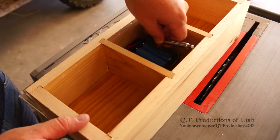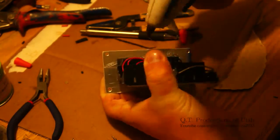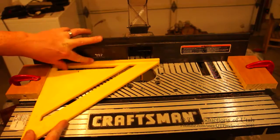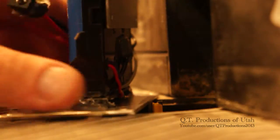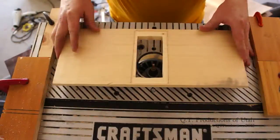I set my battery inside and mark a rectangular hole around the top end, which I then cut out. I drill carefully marked holes into another piece of aluminum and hot glue tiny squares of plexiglass on the underside over the smaller holes, then carefully line the holes up above the LEDs and hot glue the faceplate on. I center the battery in my box, trace around the face, and clamp pieces of wood to the sides of the router table squared with the fence. I set everything up so the dado bit can only cut as deep as the faceplate is thick and only within the traced outline, resulting in a nice indentation the battery's faceplate rests in. I repeat the process for the amp, putting it front and center.